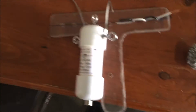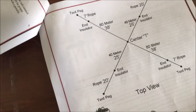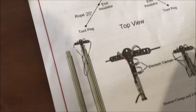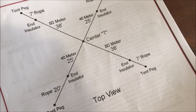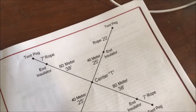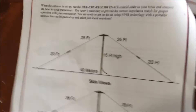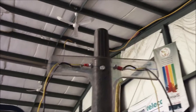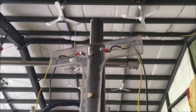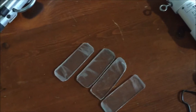I've got to cut the wires and mount the plate. For 80 meters I need 38 feet on each side, and for 40 meters 25 feet. I'll use the black wire for 80 and the white wire for 40, then put the corresponding rope on it. There it is — I just have to add two more pieces, and I've already made the end pieces, so now I'll hook the rope up.